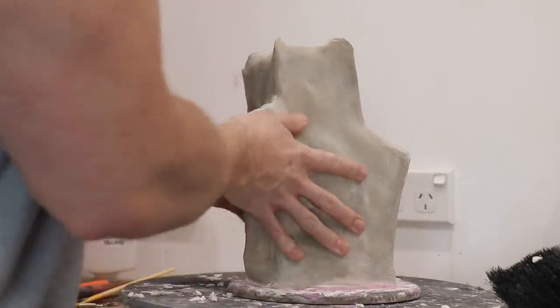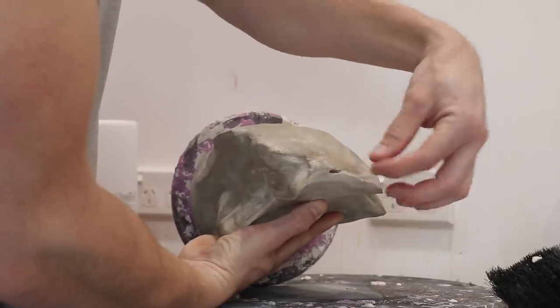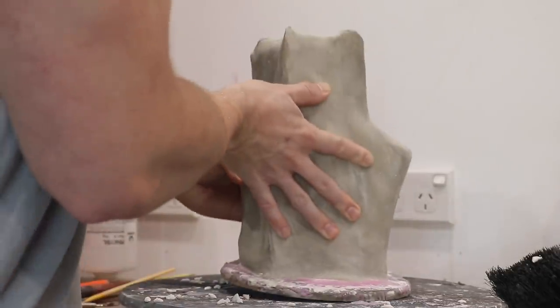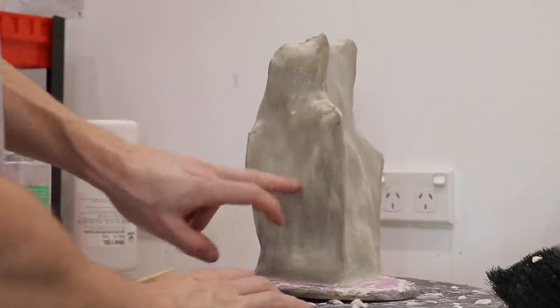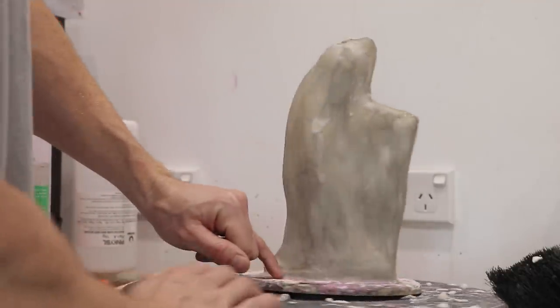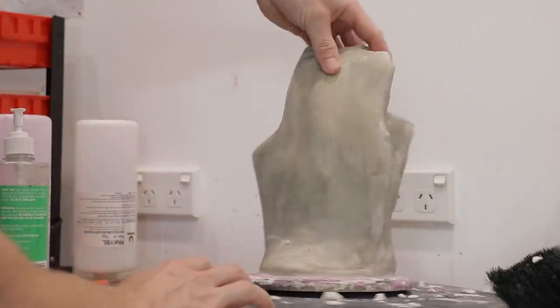So I did put a little skewer in the plaster here while it was still curing as a little area that we can tap some wooden pieces into to release it, because it is all airtight at the moment. Once you have that release, it is pretty straightforward from there. So obviously we've got the 1, 2, 3 pieces that need to come apart. I'm also gonna cleanly cut the silicone away here with a Stanley knife, and then we can peel the glove mold off. And we can finally get to the fun stuff.